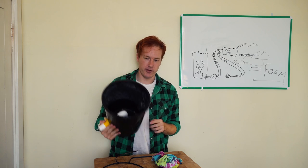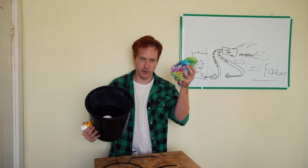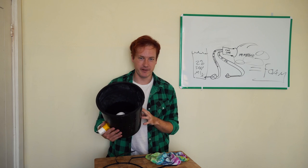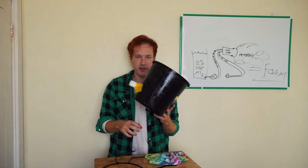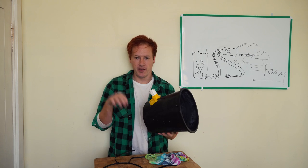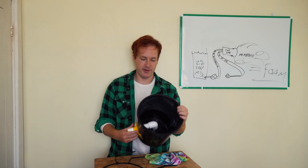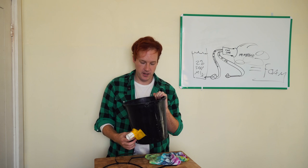For the water, in the very bottom I have a fitting that the water comes in through, with a little sprinkler nozzle on top which helps atomize the water and more evenly soak the membrane. This does make it a pain to mount the foam cone because there's a hose coming off the bottom. In the next revision, we'll have the same setup for the air inlet but put the nozzle pointing up towards the membrane instead.